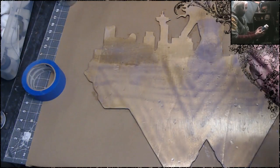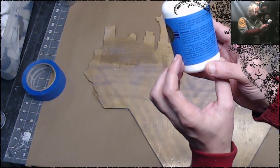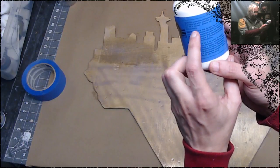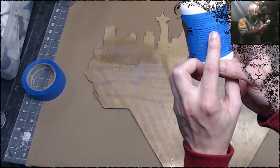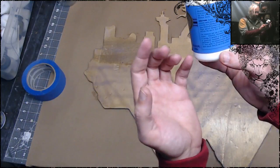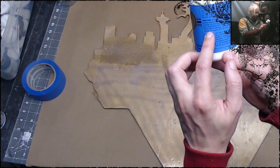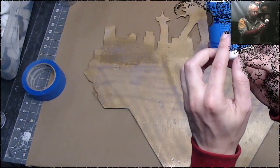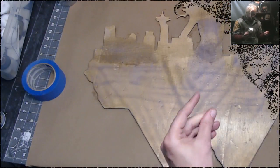99% of the time, you're gonna look on a bottle. You want to actually see how long it's gonna take to dry. Okay, it's water-based gilding adhesive, designed for blah blah blah. Directions: surface must be clean, dry, blah blah. Product is to be protected from freezing. That's not directions. Apply Aquasize by brush or spray at package consistency. Oh, there we go. Proper tack will develop in 25 minutes at normal humidity, and hold this tack for 24 to 26 hours. Cool.